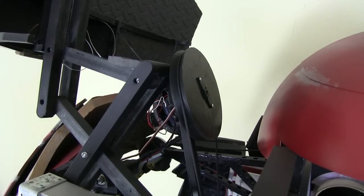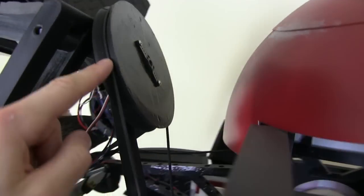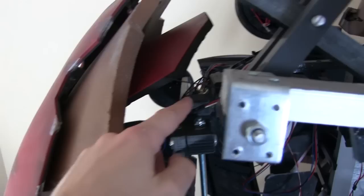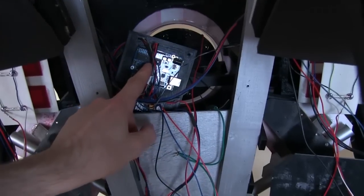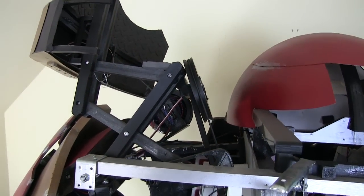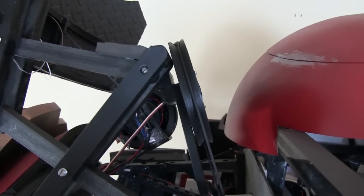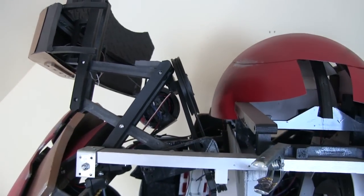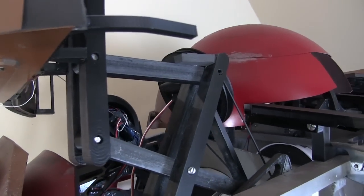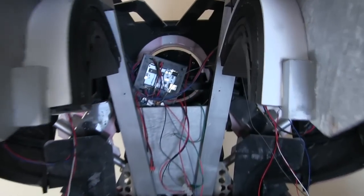The shoulder mechanisms themselves are driven by a servo which rotates the whole thing around, and also another servo with a rather large pulley that pulls the shoulder up and down as it turns. The wires for that run all the way around via this blue wire to that Arduino. These mechanisms aren't as good as they look — they sometimes jam and bad things happen, and they sometimes don't home properly which upsets the servo quite a lot. These are 15 kilogram per centimeter torque servos, which are quite hefty, and they sit there chattering away getting very hot. So what I actually want to do is get all this working again, but have it actually power the servo off completely when it's in the home position so it doesn't sit there chattering away, getting hot and drawing current. Then I'm going to have a relay that switches the servo on when it's in use — that needs to be on another digital output from this Arduino. Then hopefully once that works and the buttons on the breadboard work, we can go and put some smartphone control in.